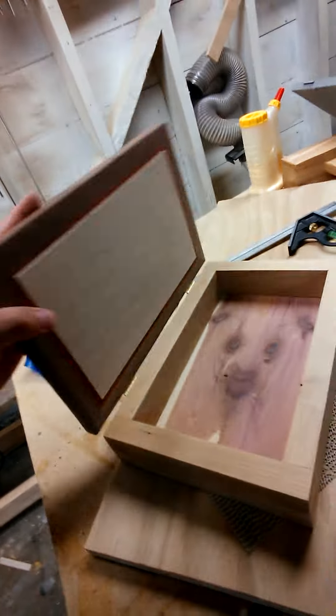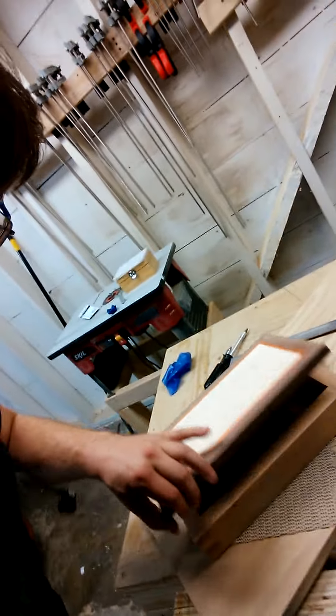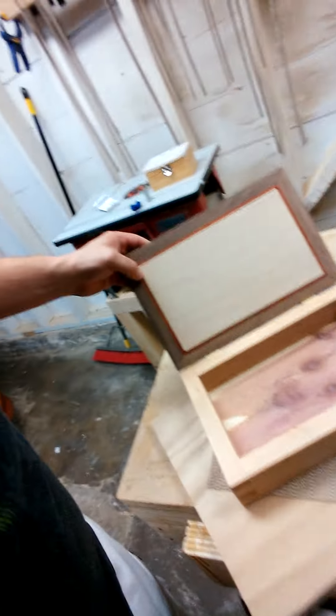What I'm doing with this is there are little hinges on the back. Eventually I've got to get a little string so when it opens it doesn't just flap open. Originally I was not going to put any hinges on it, because personally I don't like using a lot of metal stuff. But it's a jewelry box — that's what most people expect from a jewelry box, so that's the idea I'm rolling with. It's pretty dope. And it smells freaking awesome in there. So this is the unfinished version — I haven't done any kind of finish to it yet. I'm going to be using an oil finish, because I freaking love oil finishes, and it's going to be inside so I don't have to worry about UV or anything like that.